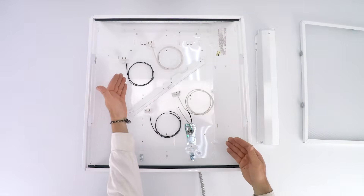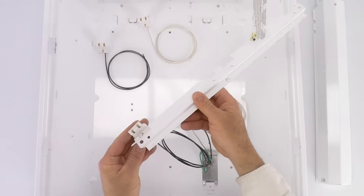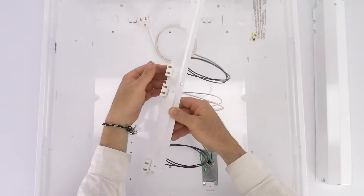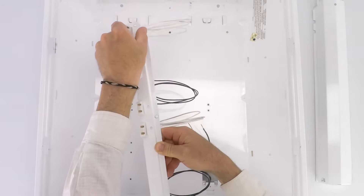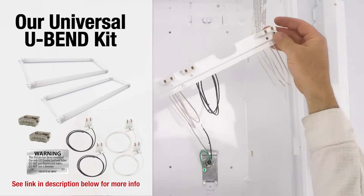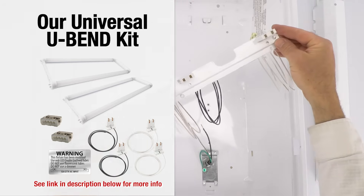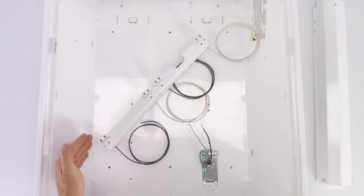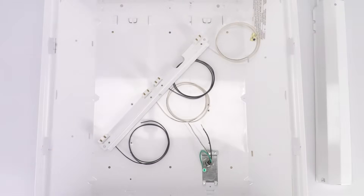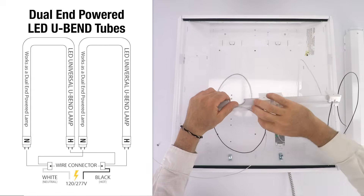You want to put our sockets — the ones supplied in our kit — into your socket plate. They just slide in; it's real simple. They don't lock in with a special mechanism, they just slide in, so you've got to keep them in. The kit we send you has two sockets with black wires and two sockets with white wires — two hot and two neutral. Install them as shown in this plate: one, one, one, one across. The light bulb is going to get a white wire and a black wire, one on each end — that's why we call it a dual end.